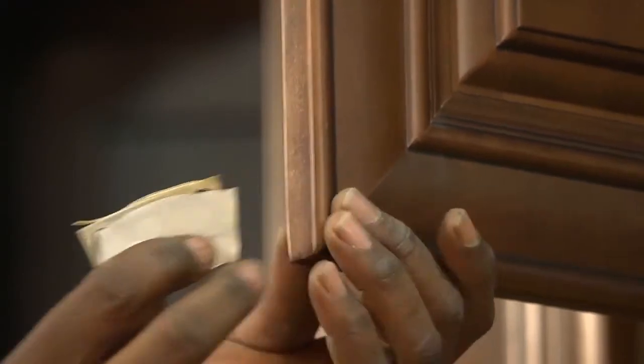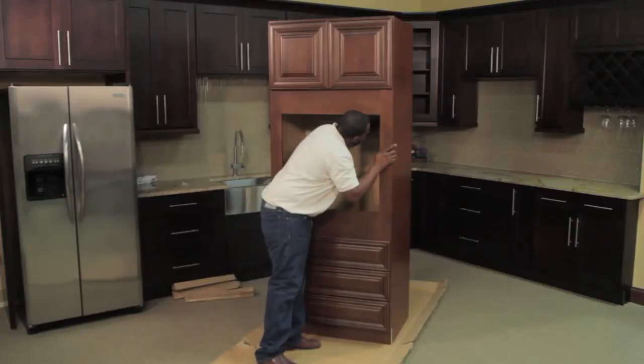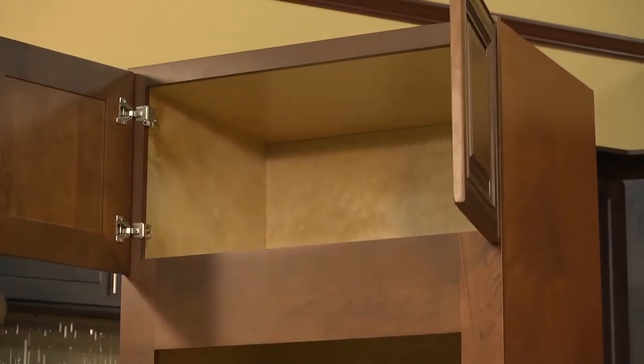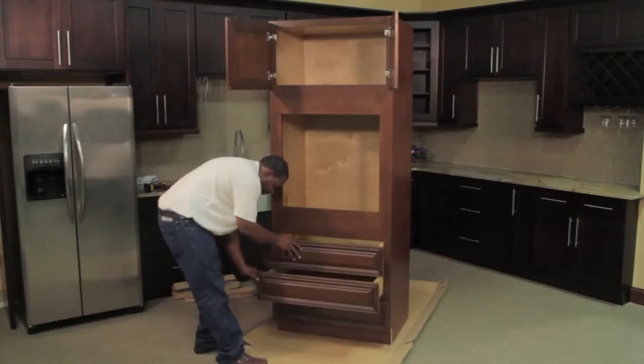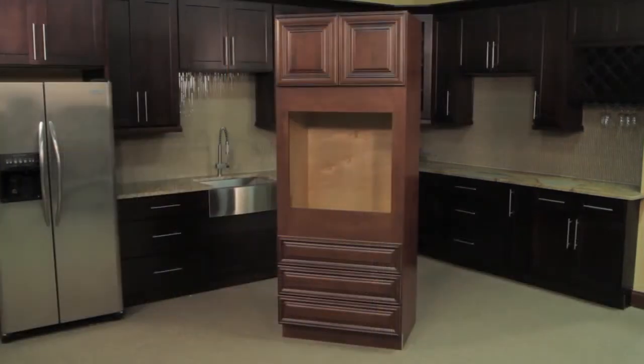Next, place a bumper on all corners of the doors and drawers. Now use the silver flush mount screws to finish mounting the last clips located on the underside of the upper middle panel inside of the cabinet. You will notice another shelf board available along with two support boards — these pieces will not be installed until the oven is ready for installation. Now the cabinet is complete and ready for installation. Clean the cabinet of any unwanted glue or debris.